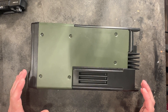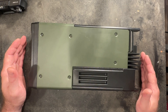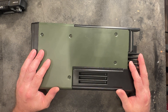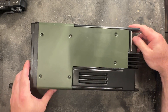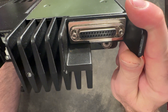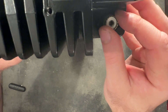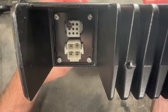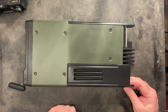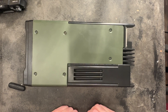To further elaborate on this radio — if I had to describe it as an analogy, imagine Gina Carano and Chuck Norris making a baby in a Radio Shack. That's what you've got right here. On the back there is a DB25 accessory port giving you access to PTT, audio in and out, and some auxiliary functions. You've got your UHF SO-239/PL-259 connection, and your power and accessory plug. The entire body is manufactured from a cast magnesium-aluminum Zamak-type material that dissipates heat extremely well. Just a tank — a beast tank of a radio.